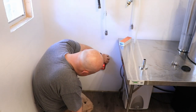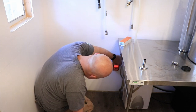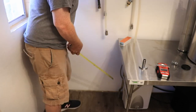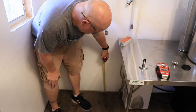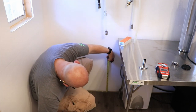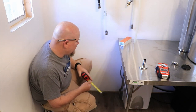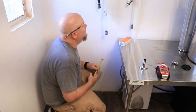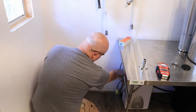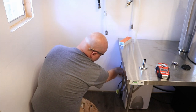What I'm doing right here is I am looking to see where there's a stud in the wall because I want to avoid drilling into a stud at all costs. Basically my goal is to drill straight through the wall and run my PEX tubing through the wall. I'm just measuring how far up I want it to go and then how far over, and then I'll take those measurements and go to the outside and find about the same placement and drill my hole.